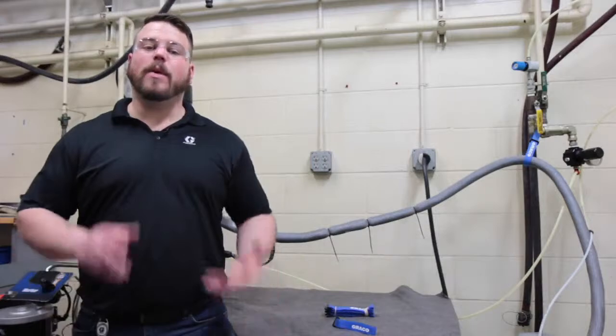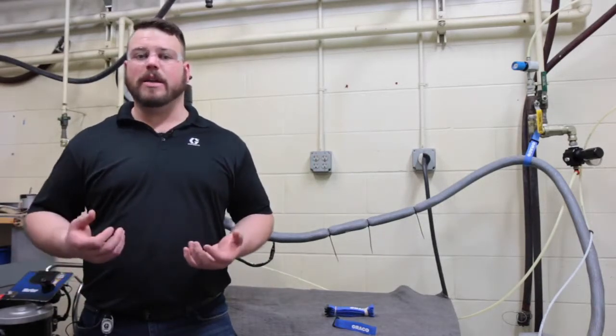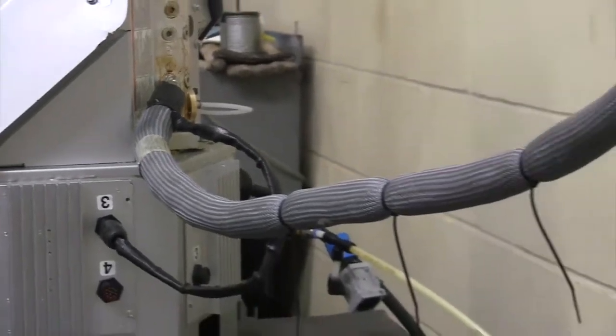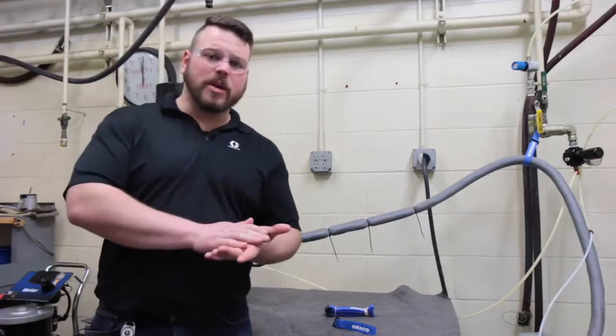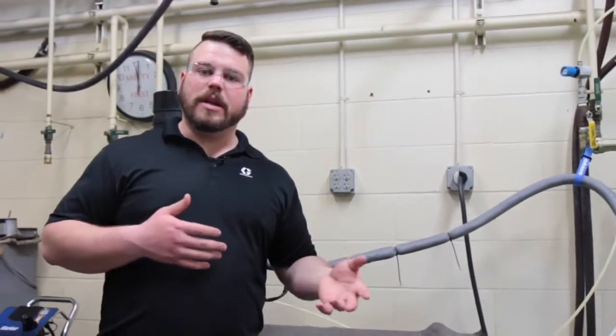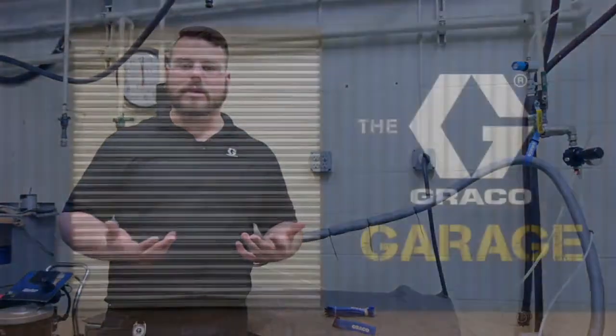In today's episode, I want to discuss some of the how-tos and best practices around maintaining your non-wash down heated hose to get the best lifespan and performance possible. In today's hoses, we have a localized either addition of insulation or removal of insulation. We can get hot and cold spots in the hose that create hot and cold spots of the adhesive, which can lead to increased char and reduced hose performance.